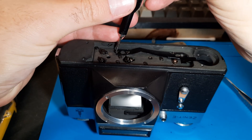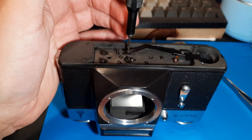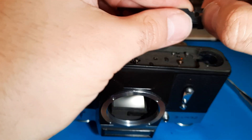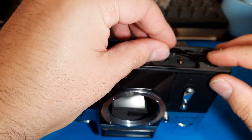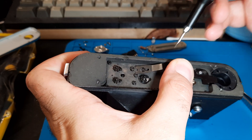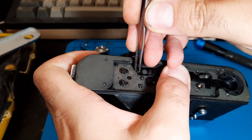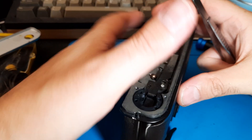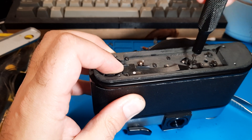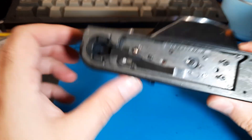So we'll use this as an opportunity to rerun: loosen about two millimetres from the thing, loosen this one about the same — that'll ping off. Pull this up because it actually slides into there. See, there it's fallen in a bit — that's fine. Slide it down so it's over the little slot that's in there. Then grab with a pair of tweezers, pop these up, and slide that along — boom, you're in. Then just hold that in place and tighten to full tightness. There's no particular torque or anything that seems critical for this. Then test.